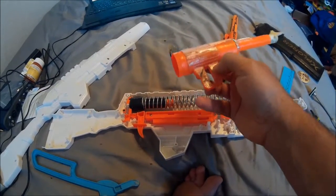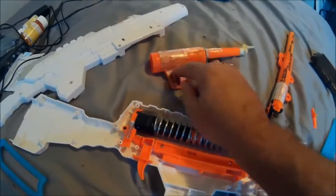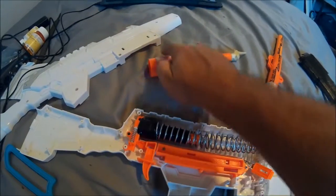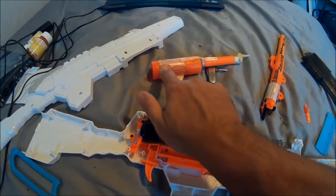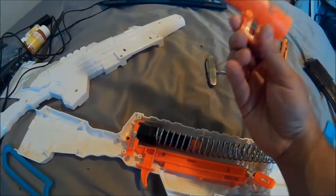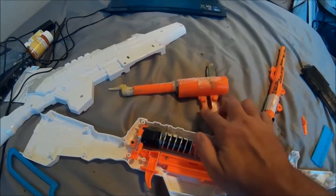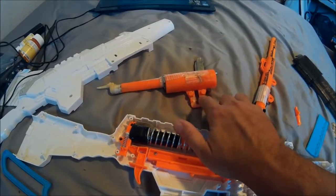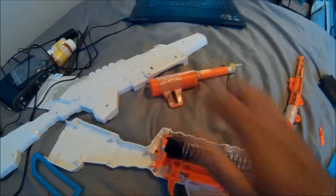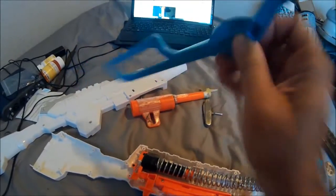And then I took the fiber tape, that same piece of fiber tape on the outside, and wrapped it all the way around. What this does is it makes it so when this pulls, the fiberglass reinforcements are pulling on this, and this is also epoxied in two layers in here. You can see there's some drag marks here, but the laminate is still intact, and that keeps this U-joint from breaking. The other side doesn't have any fiber tape that's hooked into this. It has some here to reinforce on this side, but in reality, the cross-lateral fiber reinforcement is all here. This is one reason why I was able to pull 25K to the point where one of these actually broke and this didn't.